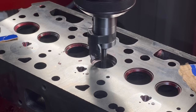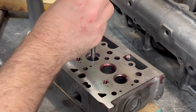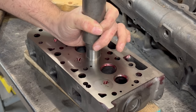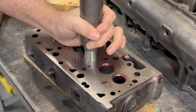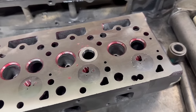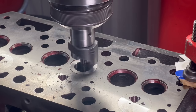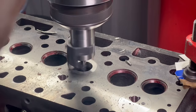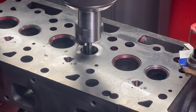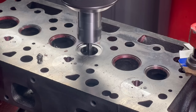The next morning we were ready to make the install on the replacement exhaust seat. We first used an angle cutter to lightly chamfer the top of the bore to ease in the installation and prevent any possible galling. With a pilot in the valve guide to guide our driver, the new seat was hammered into place, and from experience it felt like a very good amount of press fit. The ID of the new seat does need to be opened up, and the seat is too tall and will need to be trimmed. By zeroing a 90-degree cutter on the surface of the head, we have a reference point for how much we need to trim off the top of the seat. The factory exhaust seats actually sat a bit low in the counterbores, so we set up a cutter to the same diameter as the factory counterbore and counterbored the new seat to match.